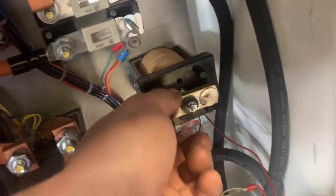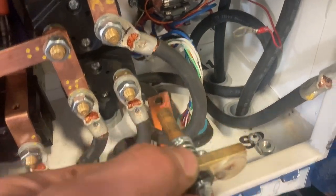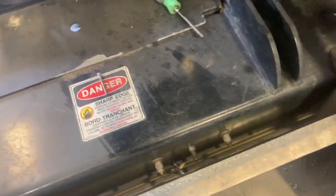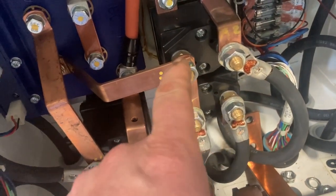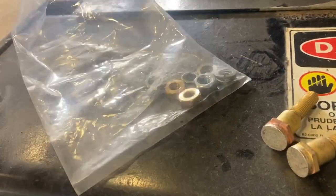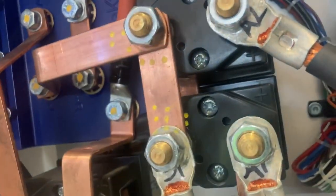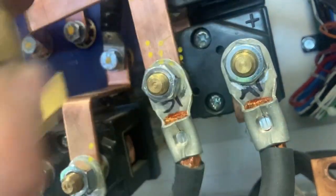Here's what it looks like inside — you can see there is some wear, especially on that hot side. I'll be replacing those. I forgot I had to take that little switch off the outside to get those two big screws out, then you can pull that out and take your contacts out. Make sure you disconnect your batteries before you start working on it. You can buy these from your dealership — get all the individual pieces and replace them as needed. They're all the same through the different relays, so if you replace all of them you just order more of the same parts and get a kit with all your parts.